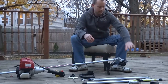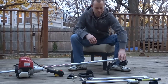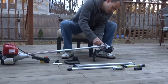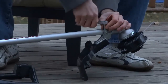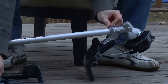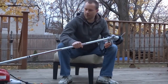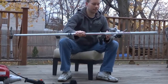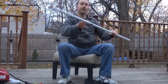Next, I'm going to remove the trimmer drive shaft assembly. You'll need the 8mm socket for this. There are three bolts here that you'll need to loosen up. Once loosened, I should be able to remove the trimmer drive shaft — the drive shaft assembly tube — from the trimmer. The tube you can sell or discard; it's not necessary for this project.